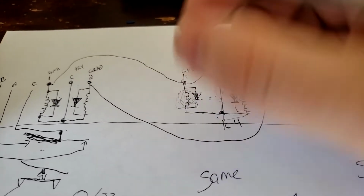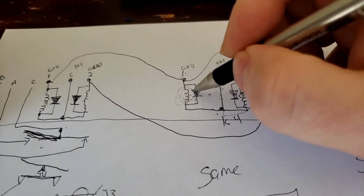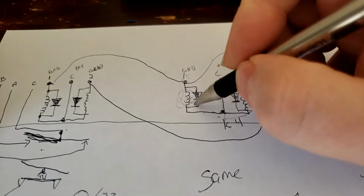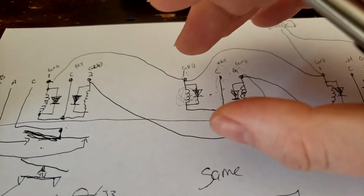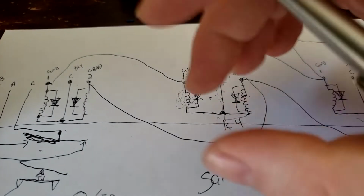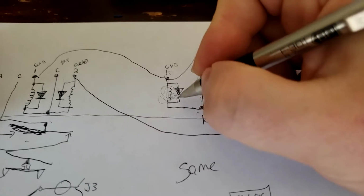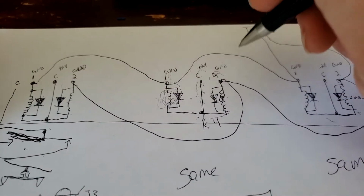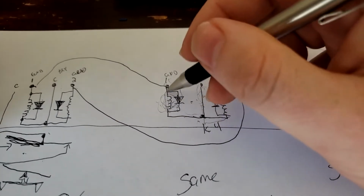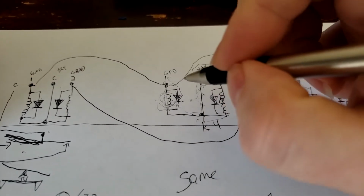the polarity of it immediately reverses, okay? And when it does that, it can get rid of the potential across the coil and go back to a state pre 24 volts, right? The amount of time that it takes to dissipate that is no different than the amount of time, the coefficient, that it takes to equal out to the 24 volts VDC applied.